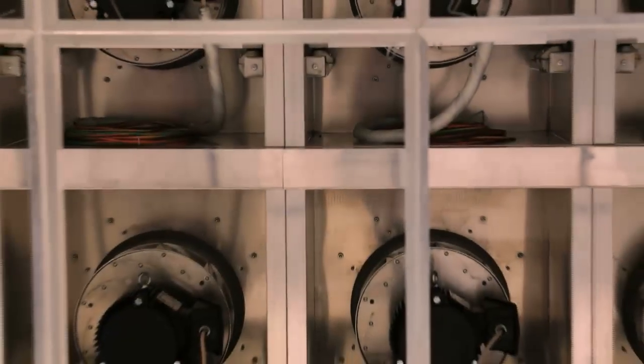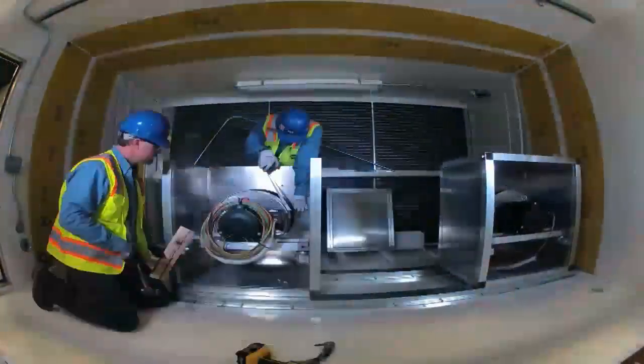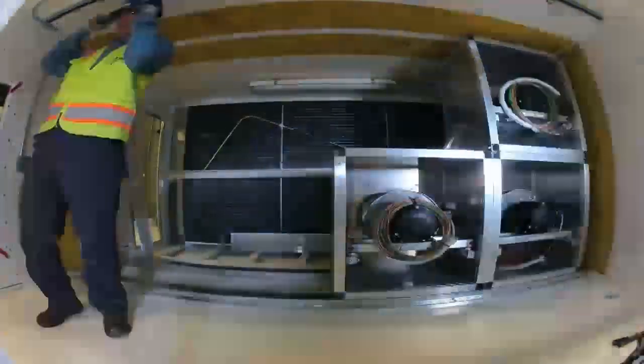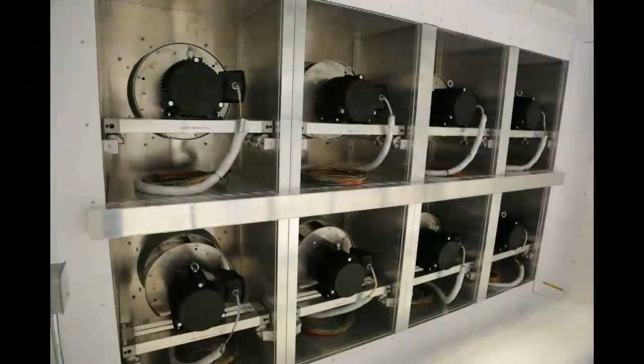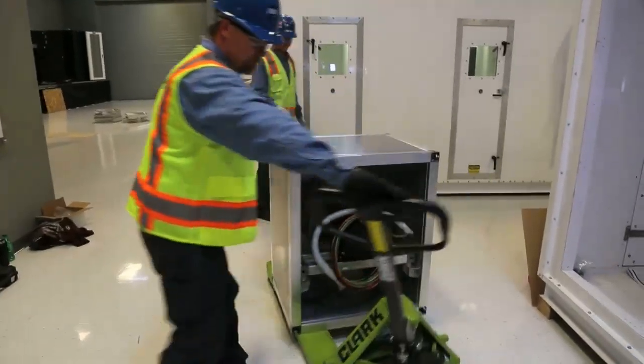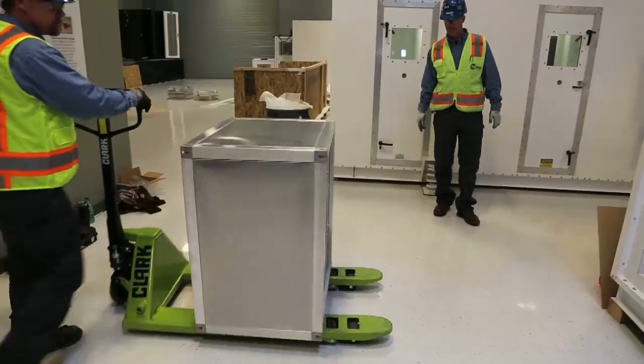The mechanical installation of this fan wall retrofit took approximately six and a half hours. It is easy to envision that a knockdown fan wall retrofit could be completed over a weekend shutdown, from demo of the existing fan to full startup of the newly installed fan wall system. Of course, if fully assembled fan wall cells can be brought into the unit, then additional time savings will result.